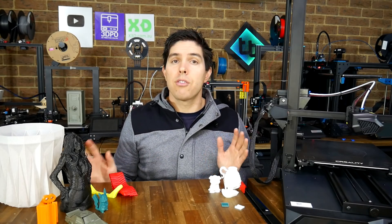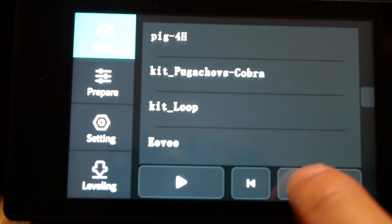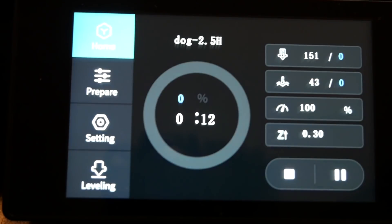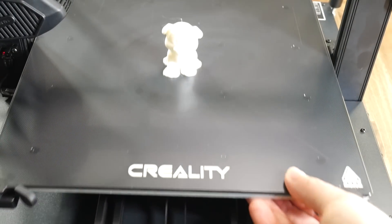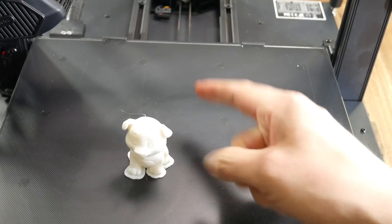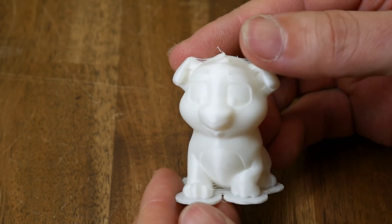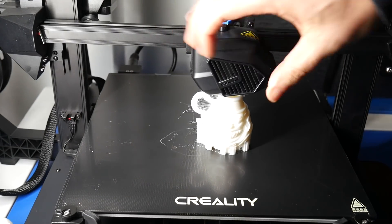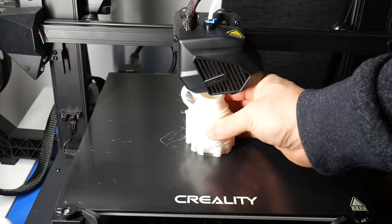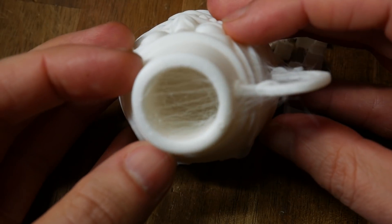I completed a range of test prints in various materials. Starting with the pre-sliced G-code and the included filament, the first test print was actually a failure because the heated bed temperature was too low. After restarting and overriding the temperature on the LCD, the print stuck and completed successfully. The surface finish was quite glossy and nice but had a little stringing — overall, not a bad first result. The next SD print, called Pot of Greed, printed with support that I could remove with my bare hands, but suffered from quite pronounced stringing, especially on the inside.